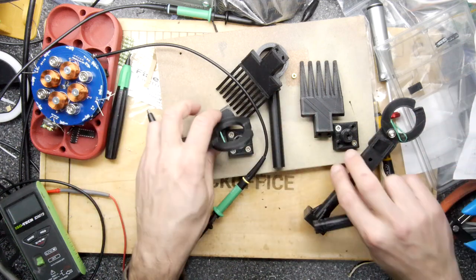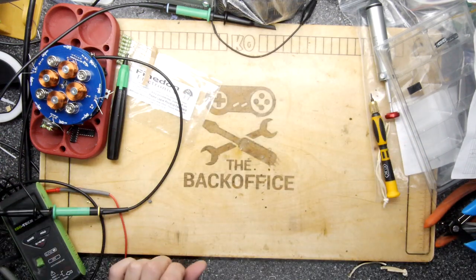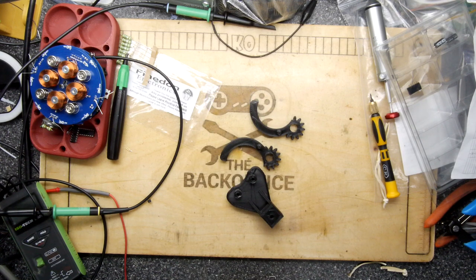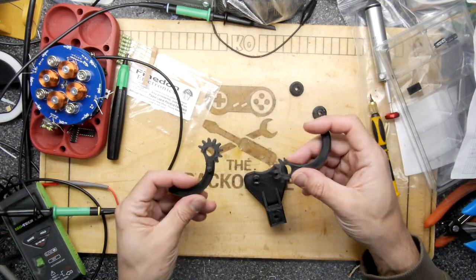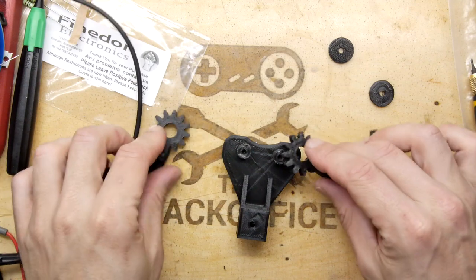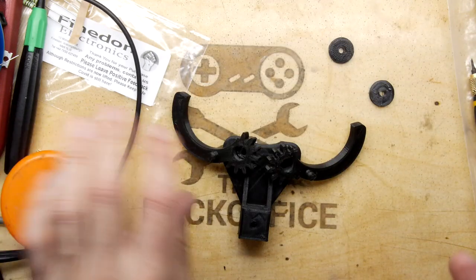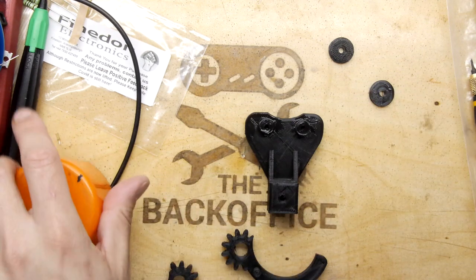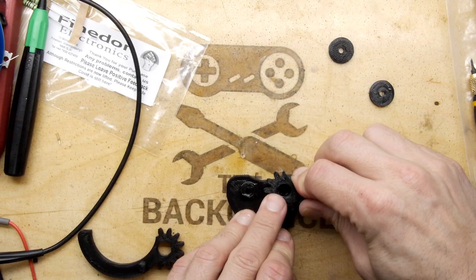The actual star of the show is this — it's literally just finished printing. I wanted to try another end effector design purely because I wanted to learn how to do spur gears in Fusion. I designed up some spur gears and we're going to test it out. I'm going to grab a bit of silicone spray just because there are no bearings here — just a kiss of it on those faces to make sure it can run. Oh, it is a bit tight.